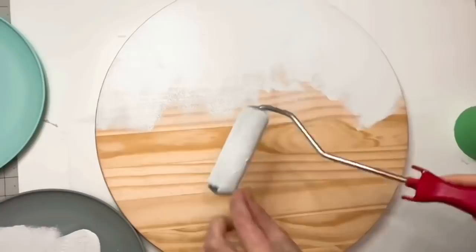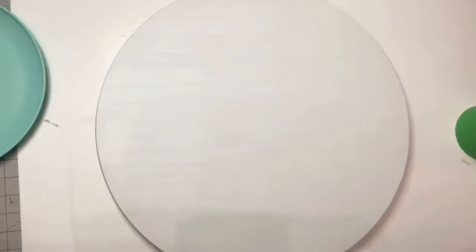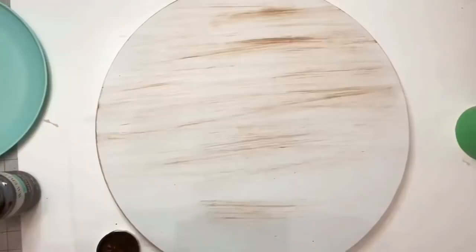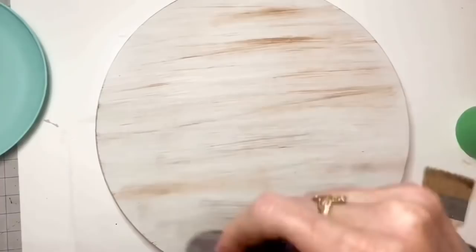This sponge gives you a nice smooth finish on your base color. I go in with one coat of white — I like that you could still see the wood grain. Then I'm taking antique wax and a chippy brush and just going over this baby and distressing it. I do not like stark white, and for this romantic vintage feel I was going for, it really needed something more than just white.